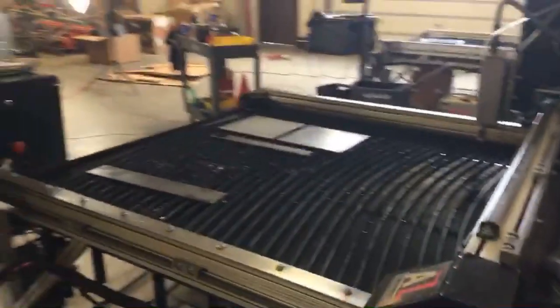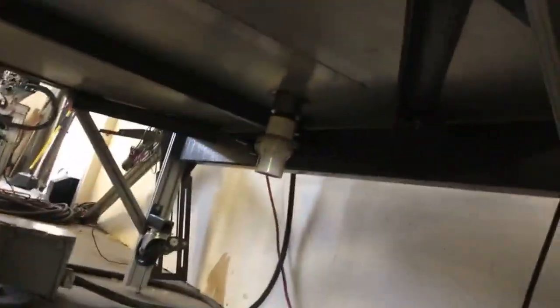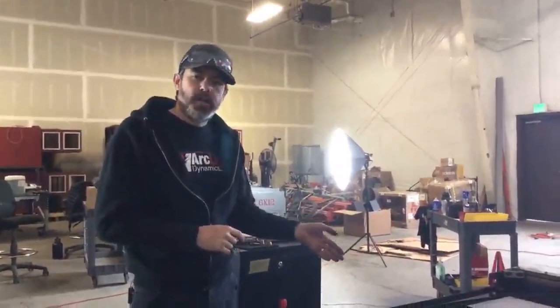That water can be drained out of your water pan via the 1-inch ball valve that you have in the back there. That 1-inch ball valve allows you to drain the water out so you can do your clean out. Perhaps at the end of the school year, you're going to drain the water out and have the students pull the slats. Now, of course, these slats are extremely sharp.